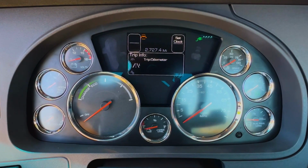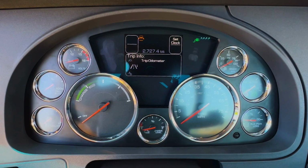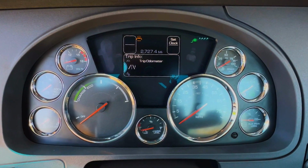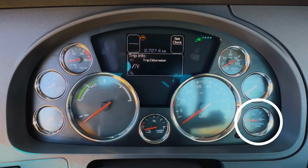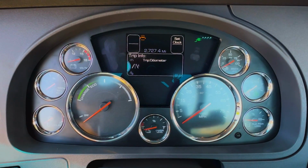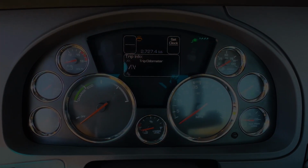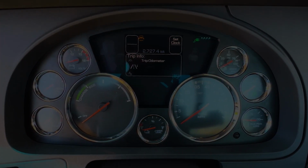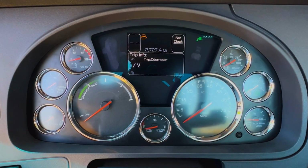A neat feature of this is that you can see both the power output as you use the motor as well as the power input as the regen braking recharges the batteries. Other helpful gauges include the auxiliary power loss gauge and motor torque available gauge. A handful of telltales will light up if there are issues, including the turtle light indicating limited performance, also known as below 25% power output limited.